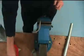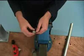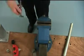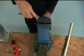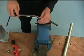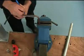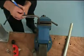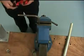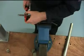At this point we should try the 10mm olive onto the pipe to make sure it will fit, and also the 10mm nut. Next we can remove the pipe from the vise and turn the bent pipe over. This time we are going to take a measurement from the outside of the pipe and measure to 115mm. Once again we mark this on our pipe, then cut this end and deburr the pipe in exactly the same way as we cut the other end.